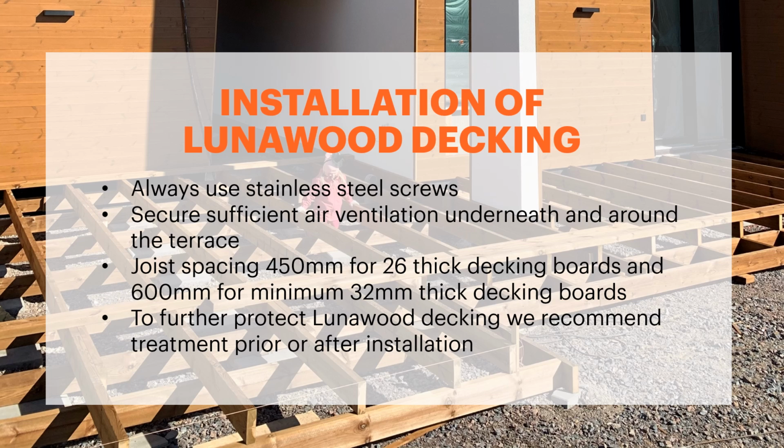There needs to be sufficient ventilation and airflow underneath the decking so that the underconstruction stays dry and does not affect the thermowood. We do not recommend to fully seal the sides of the terrace with any kind of material in order to secure the sufficient airflow.